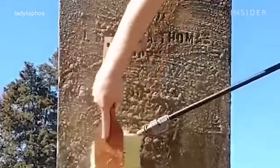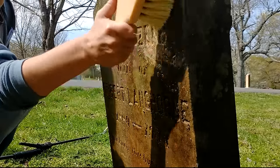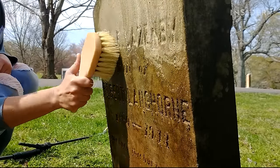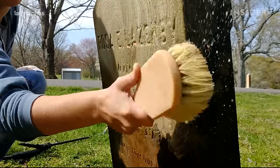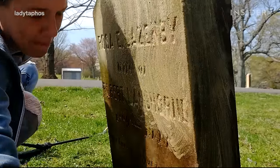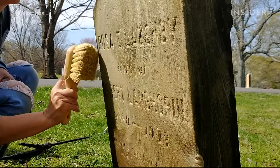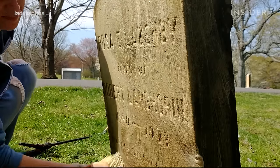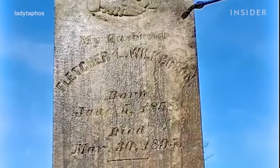I do not press hard — it's pretty gentle. If it's a newer polished granite marker you can be a little bit more aggressive with those because it's a stronger stone and typically they're modern and able to withstand a little bit more than the older ones. Once I feel like I've gotten the bulk of it off, then I give it a good rinse and let it dry.